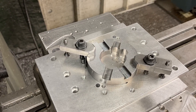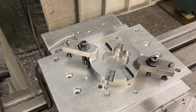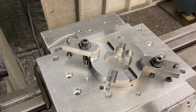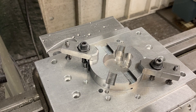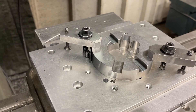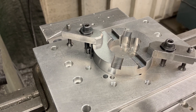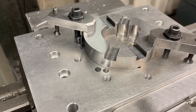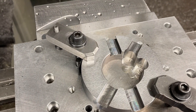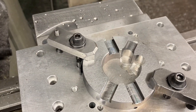Here we are at Titan Machine Tool today, making some steel keyway discs. Made of mild steel, nothing fancy. We're up to the milling. I'll show you how I got here so far. I cut these on the lathe — make slugs, turn the OD, bore the ID. I do all that round work on the lathe.